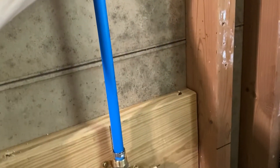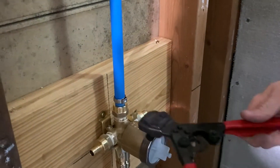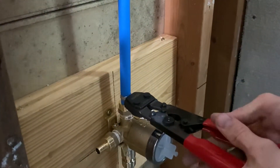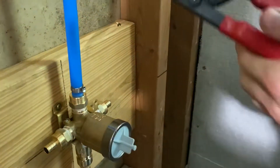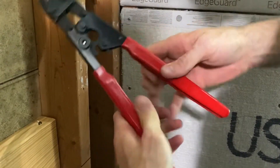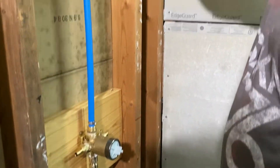Can you hold that down like that, just keep it nice and straight? I think this is so nice because plumbing is very intimidating for a lot of people — they think they have to do soldering. With this one, you know when it's done because if you cinch only part way it won't come undone; you actually have to go in all the way before it will release, so you know when you've got it properly. Hopefully that's good now.